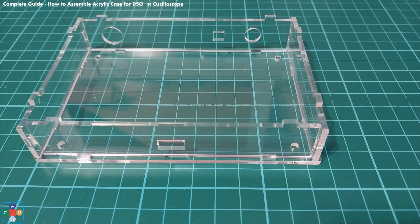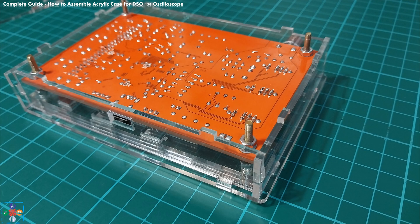Using the remaining bottom and side plates, assemble the bottom part of the oscilloscope housing. First, take the back plate — the one with cutouts for the probe and power supply — and mount it on the rest of the assembly. Sliding the oscilloscope in afterwards would be difficult because it would disturb the probe connector. Next, take the three remaining side plates and assemble them. To make your life easier, place the oscilloscope top side down when doing this part of the case build.